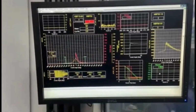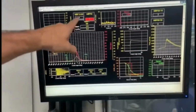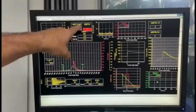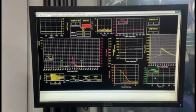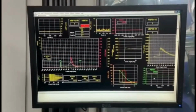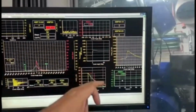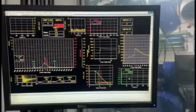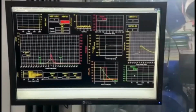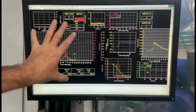We have the combustion take place by our ignition here, but controlled in terms of the maximum pressure. And you see from 10% of the mass fraction burned up to 90% of mass fraction burned occurs in only 4 or 3 degrees of the crankshaft. This is very quick. And as you can see here, from 10% to 50% mass burn fraction, we have just 2 degrees of the crankshaft. And from 50 to 90, another 2 degrees as well. So 4 degrees in total for the developed combustion flame, right? So this is what we have.